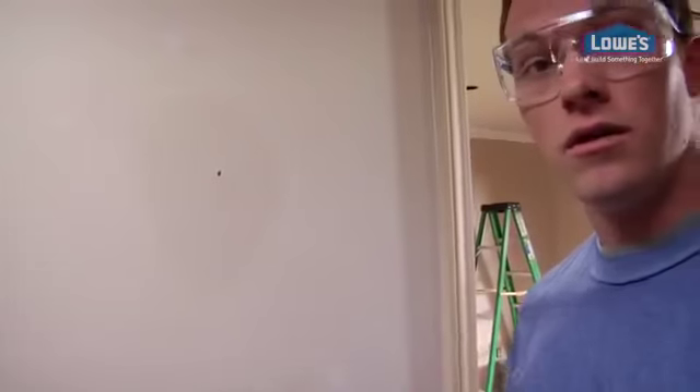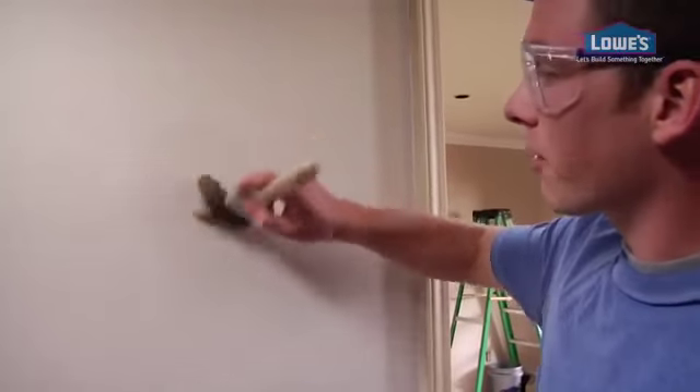What are we doing first? The first thing we want to do is clean the area. I'm going to start with the brush to get rid of the loose stuff and then clean the whole area with the soapy water so that the new spackle grabs really well, and we just wait for it to dry. After it dries, we spackle.